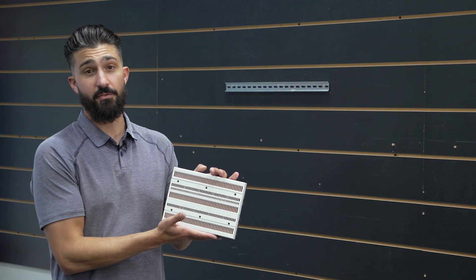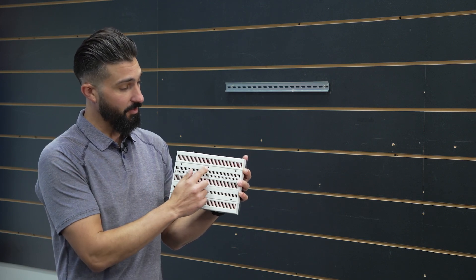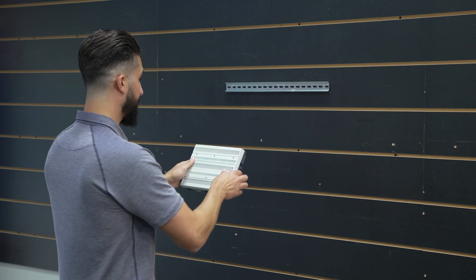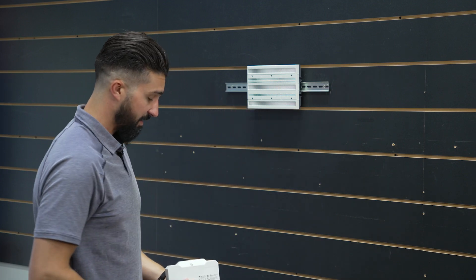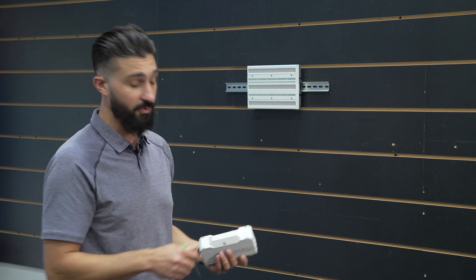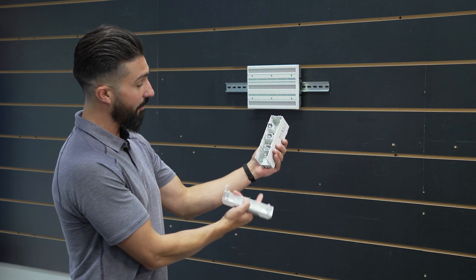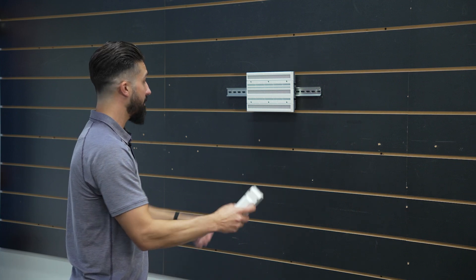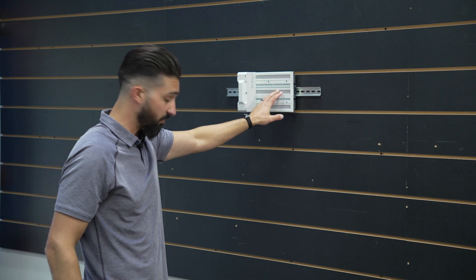I'm going to show you a quick installation of the Rockwell Crossboard system. This board can be mounted either through panel mounting, utilizing the mounting holes, or a simple DIN rail mount. Once your Crossboard is mounted, you'll want to run power to your supply module, which powers the entire Crossboard. To start, you pop your cover off, run your main power wire in, and attach it to your three-phase lugs. Once wired, you just plug it onto your Crossboard, and this will energize the bus bar located inside.